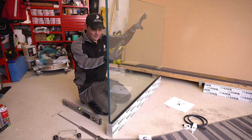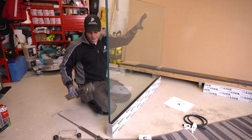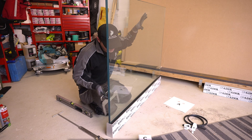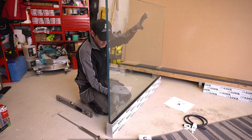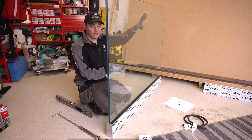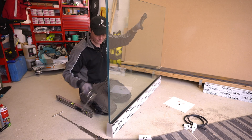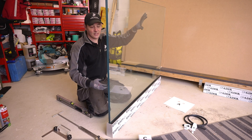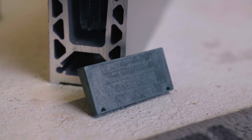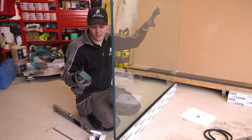We've lifted the glass into the track and now need to check it for level. To level it, use the slider tool — push it down the inside of the track and slide it left to right. Sliding left levels one way; sliding right pushes the glass the other way, and that's how you get your adjustment in the flex fit system. This particular piece of glass is pretty level so we'll go ahead and put the wedges in. They're all labelled up with On-Level's glass thicknesses and it even says which side and which way around the wedge needs to go.